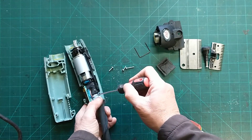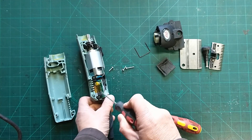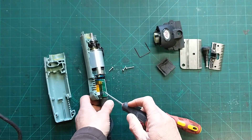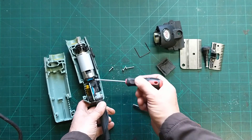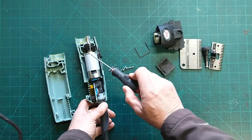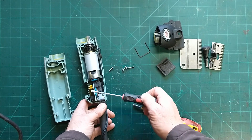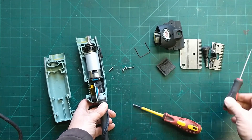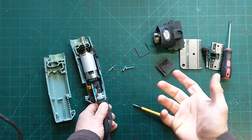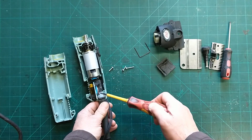That attaches to the circuit board. You've got a switch here — this part slides across and presses a button down on top, and that thermo fuse is this little box here. You can get these, but the problem is if they've started tripping, it's usually a fault somewhere between these two. I've never had any success just changing the motor — if I change the motor it invariably trips again. You have to change the motor and the circuit board, in which case you're starting to get the price of a replacement set of clippers. So they're never my favourite. I don't mind cleaning them up and sending them back to see how people get on, but I certainly wouldn't be bothered with replacing any of these parts.